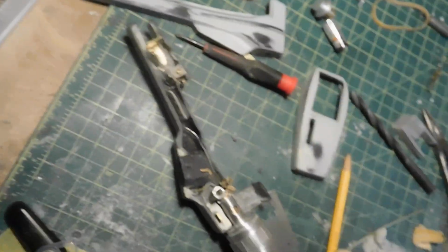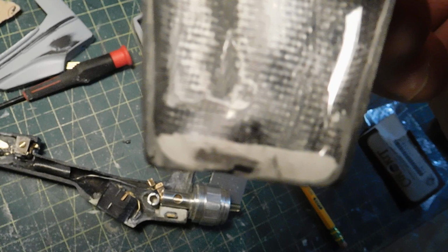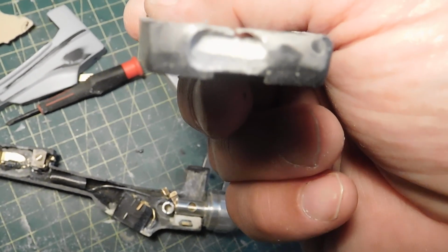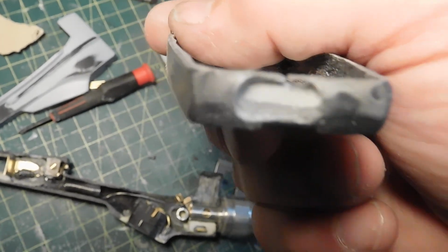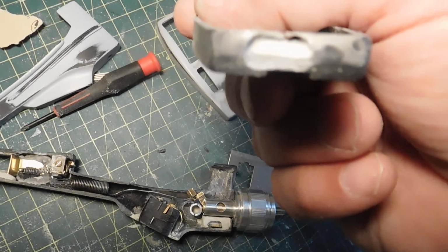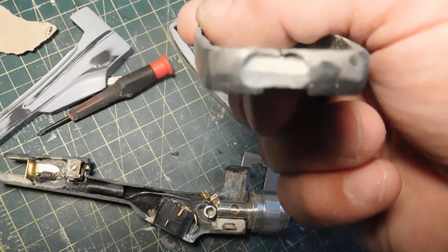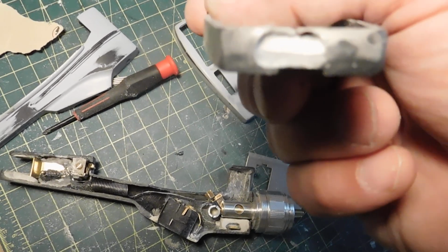Alright, here's the top. Alright, where's the bottom piece? Oh, here it is. Okay. So you could see I made a notch there. I reinforced it with epoxy, which was a good idea. All right, so that's not going to stay like that. It's a little oversized. I wanted to see exactly where the P1 is going to line up relative to the hammer. So whatever little extra space I have left over is going to be filled with Bondo or epoxy putty. Then the space will be just large enough to accommodate the hammer.